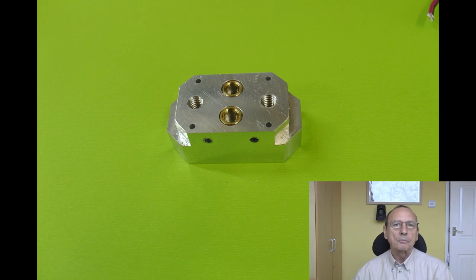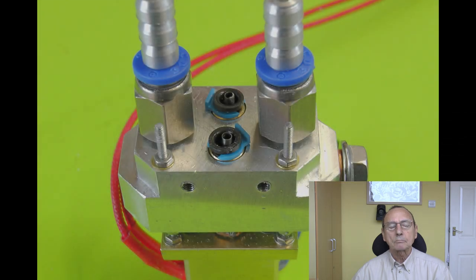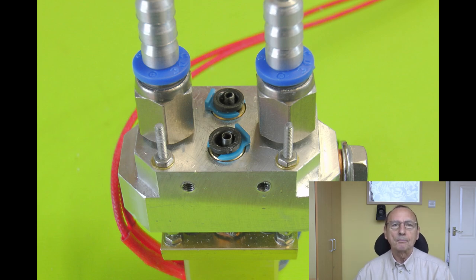The brass parts in the top are press-fit adapters for Bowden clips. So when it goes together, the top of the Mosquito heat break tube sticks up through the middle of those fittings. What I'll do is open up the end of my Bowden tube with a 2.2mm drill bit, and then the Bowden tube will slide over that stainless steel tube, and then it'll be held in with the clip. So I've still got to make the mount for that to put it on my machine, and then that'll be another hot end that I can play with.